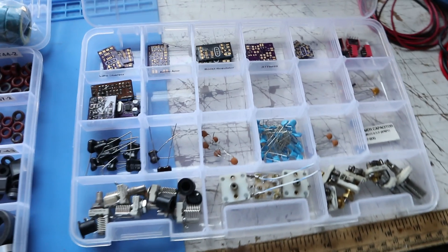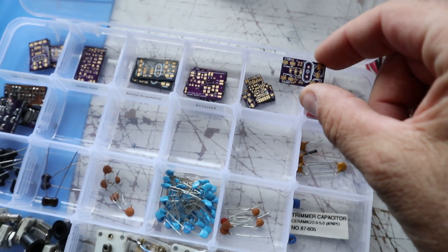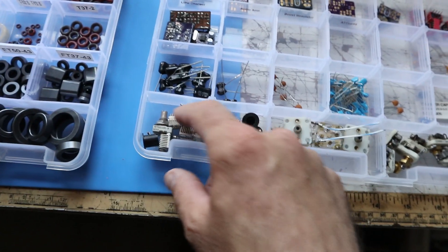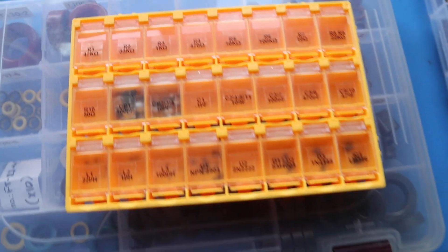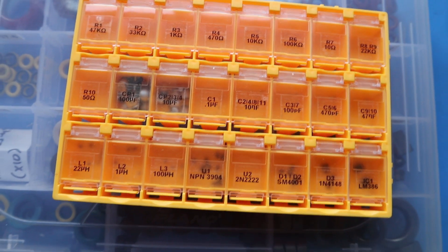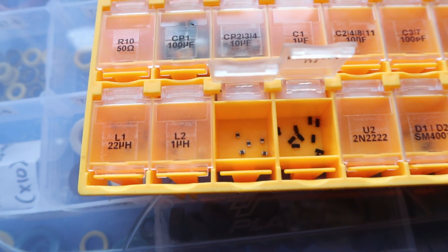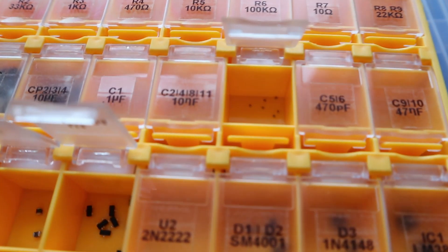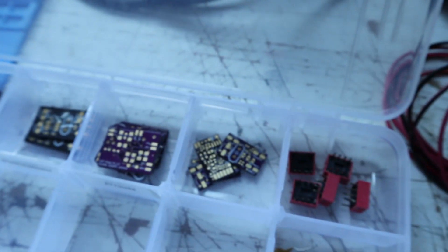Just another organizer box here with a bunch of MicroPixi circuits — various iterations of my MicroPixi. Here's the latest one: pretty small transceiver. And a variety of capacitors, including some air variables that I use for magnetic loop antennas. One more cool little tip: this box has individual storage bins for all of the surface mount components that go on the MicroPixi. You can see these tiny little bad boys — tiny inductors, 0402-sized capacitors. Yep, those little grains of sand in there are capacitors. Those are what I solder on to those dinky little boards.